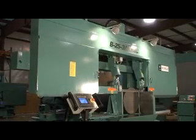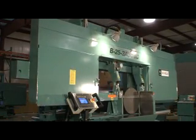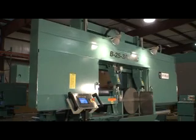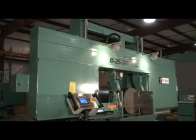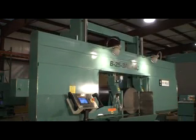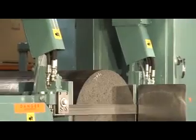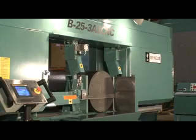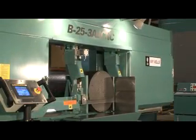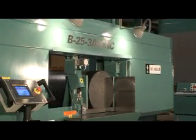The B25-3A3CNC features a variable cutting force that is quickly and accurately set for the material being cut at the operator's console. Our Precision Series 2 metering valves, which are located on the blade guides at the saw cut, control the descent rate of the saw head. The metering valves respond immediately and accurately to changing material cross sections such as rounds and structural shapes, ensuring proper cutting force throughout the entire cut. This cutting force method maximizes productivity by optimizing cycle times, reducing material waste, and maximizing saw blade life.